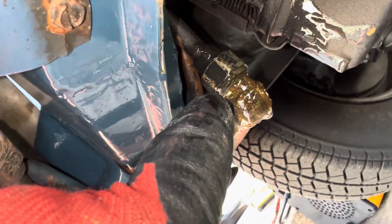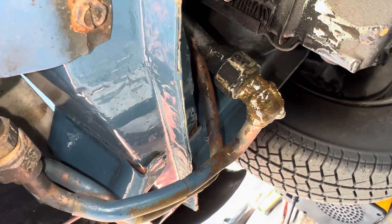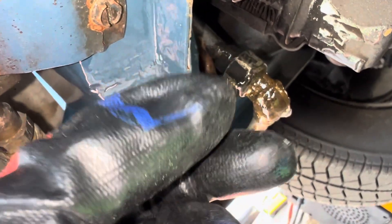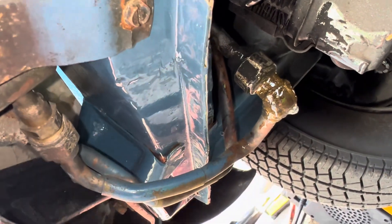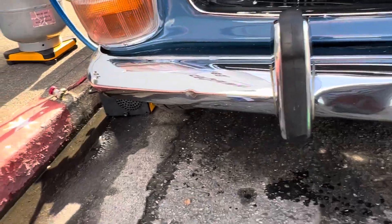This is a 45-degree flare fitting, so it probably doesn't have the original metal washer there. You would take this apart and either purchase or make a brand new soft copper metal gasket, and you would put that in that location where it's leaking. That's what you would do to that. So that's what I found on this - there are three more videos prior to this.